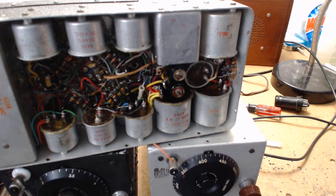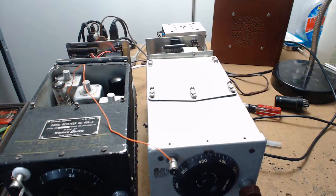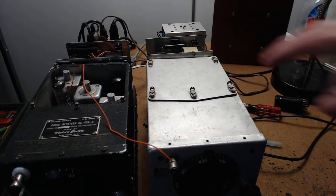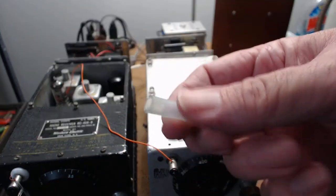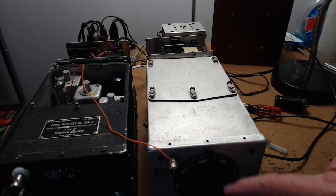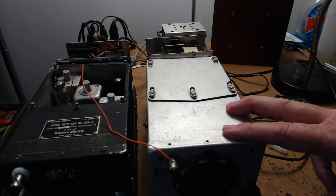The radio works very well for picking up sideband - it's a small radio. The problems I've told you before: you're going to have to recap it, you might get lucky and it will work. But the power supply is the other thing. Then the knob - use ice maker tubing, don't follow anybody's advice about hammering a brass tube on there or cementing a copper tube, because that causes the radio to be bodged.